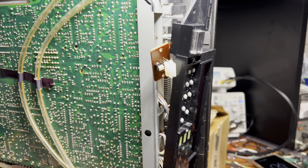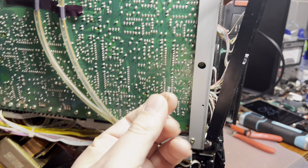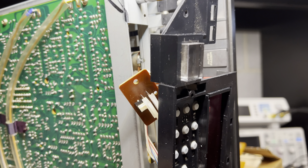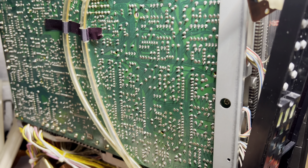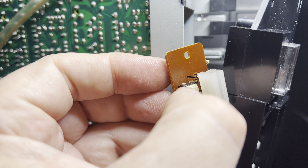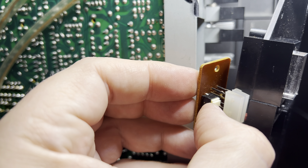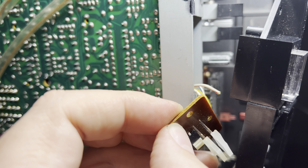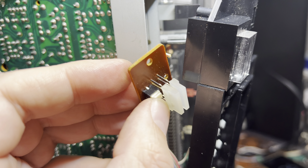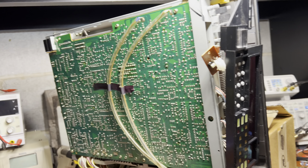Something just dropped — it was this small tiny spring which sits on the shaft and pushes the button back from below. Quite a loose design, really, and it's not even symmetrical. So I need to get to this small button and get it working. I need to disassemble it and clean it up. I also see one wire got broken while I was working on it.